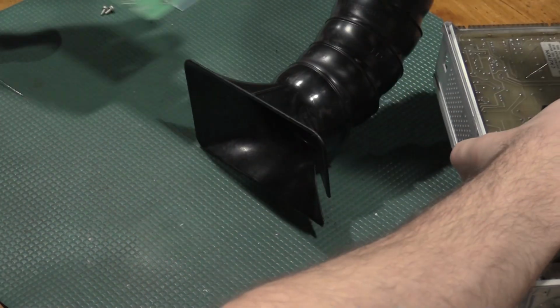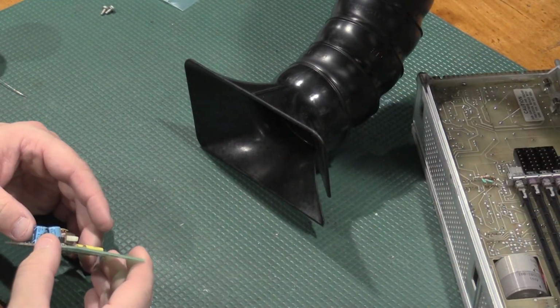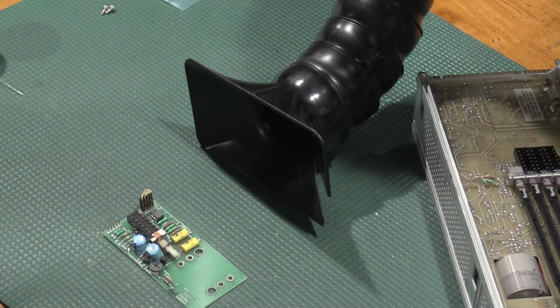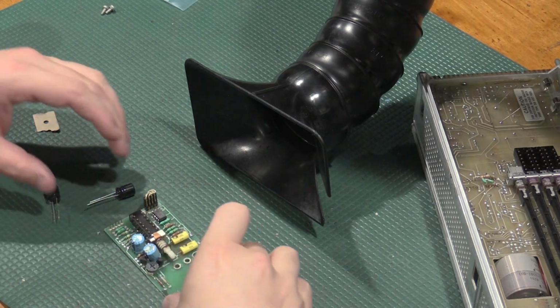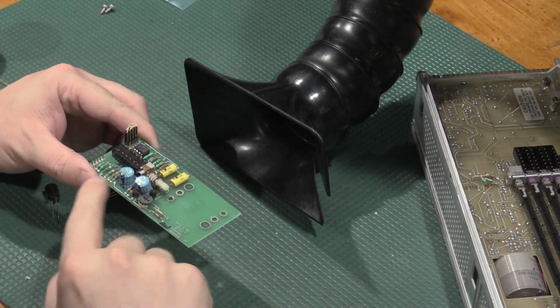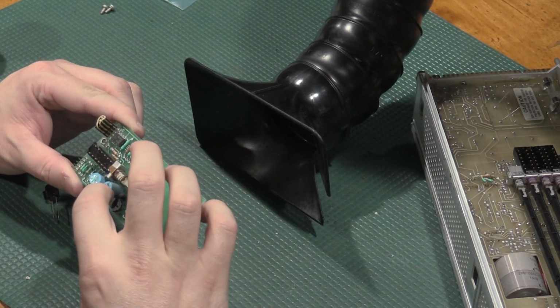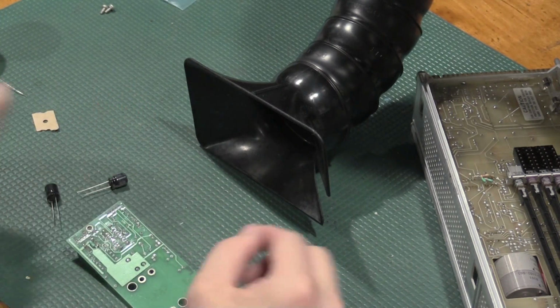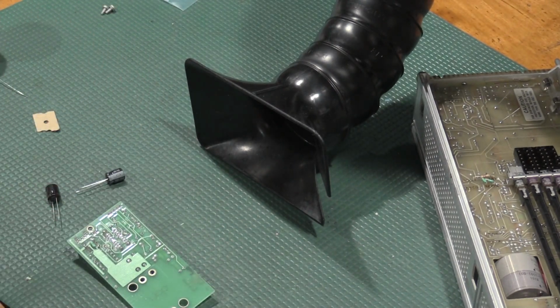Okay, let those cool off. Now we'll work on these. These are 47 mic by 35. Let's see what the lab has. All right, on this board, same drill as the first. Both of our polarity marks are towards the bottom of the board with the transistors, so we will take note of that.